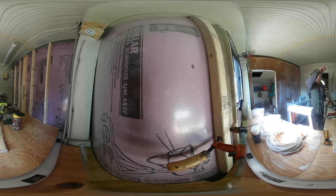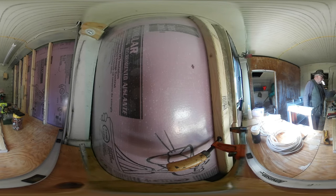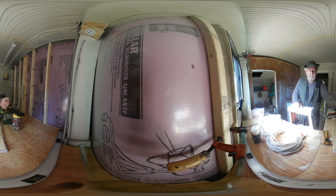This one comes across. I'm going to cut that, put a junction box in it. I can come down and bring it over. I got plenty of wire to bring it back up underneath so I'm not going across. I can put another plug over there — that's going to be a 20 amp plug. That's going to be a 15 amp plug.